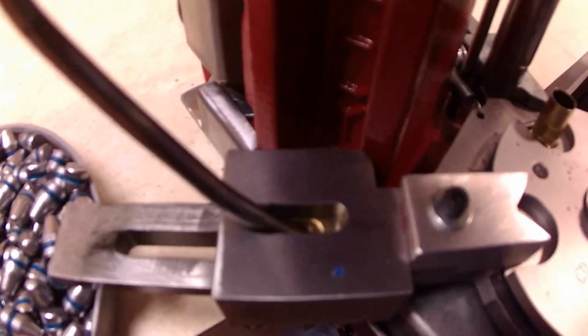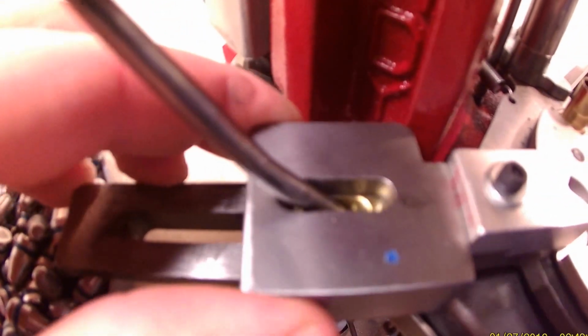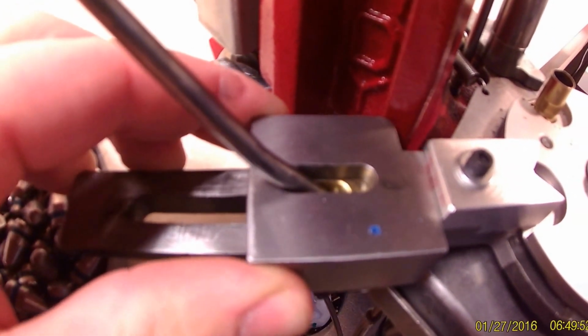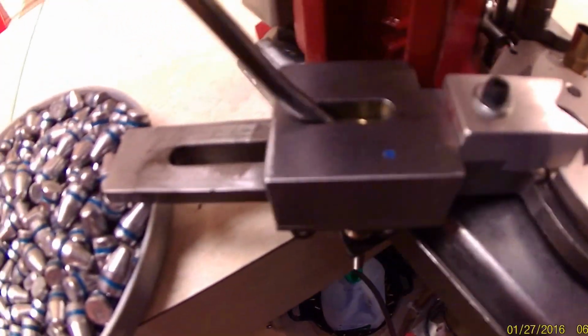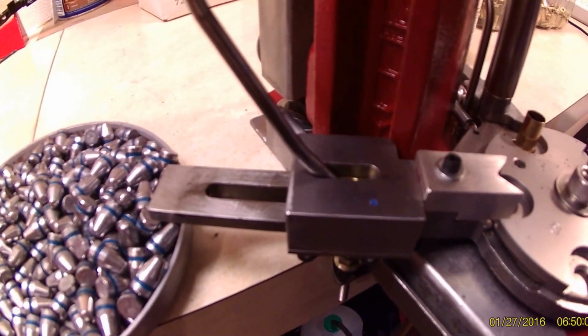The feeder arm itself has a brass insert, which is spring loaded. This allows it so once you're pushing in against the case and the case is already bottomed out, this has somewhere to go as you go down and prime. I'll take it off, show pictures of it.